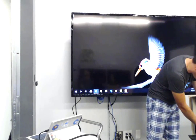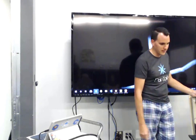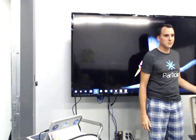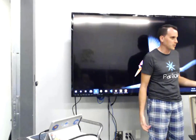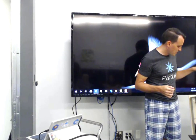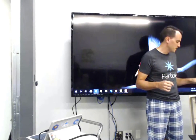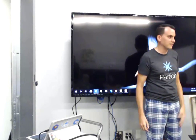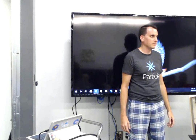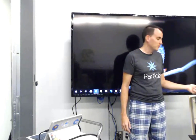Here is my solution to the connectivity. It's not really pretty, but it works. To answer your question, this whole system runs on 12 volts with a battery — there's an AC to 12-volt converter they give you when you buy the system. The Particle takes 5 volts, so you have to step that down with a variable voltage converter or a dedicated 12-to-5 volt circuit. I have a couple of relays set up here: the Particle switches at about 3 volts, which steps up through a relay to 12 volts — enough for the system to recognize something's happening. Likewise for the LEDs coming out of the system, they go through relays to step it down to about 3 volts so the board won't be fried.